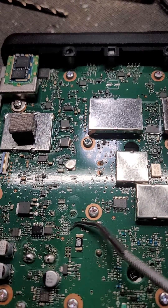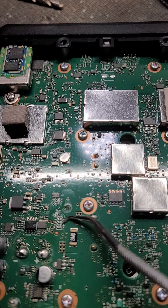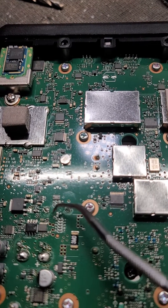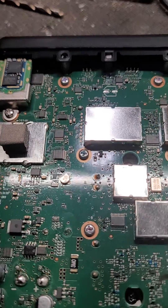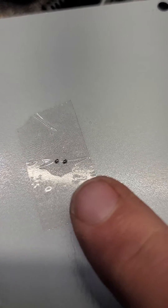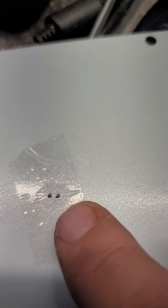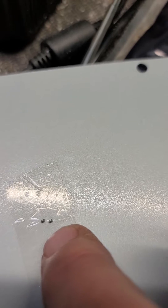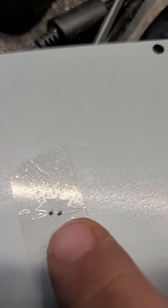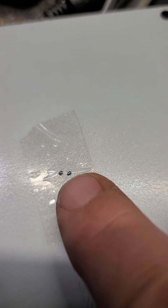That's how it's done. I just used a soldering iron, looked it up, and pulled them off with tweezers. You want to see how small they are? They're about the size of fly crap. I always tape them up underneath the lids when I do Mars mods, you know, in case someone wants to put them back in. I don't see a reason why, but there's the two diodes — look at how small they are.